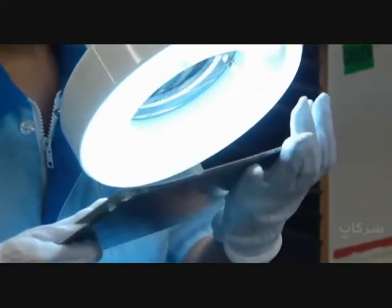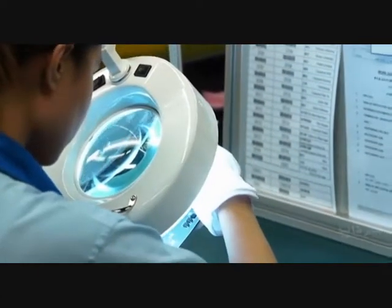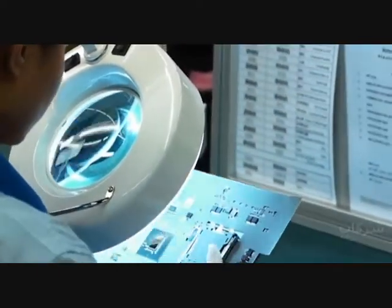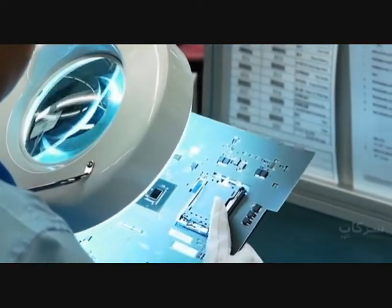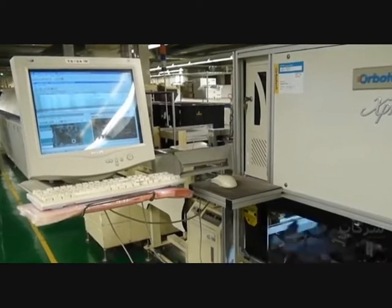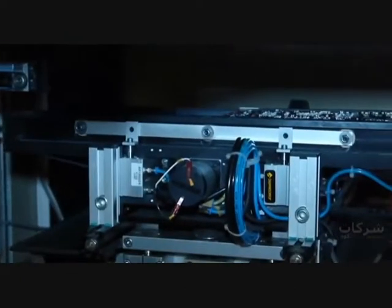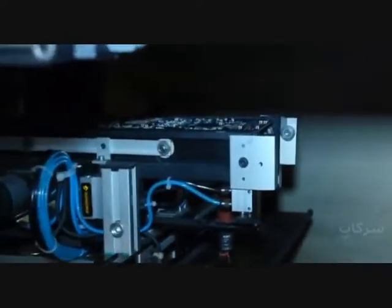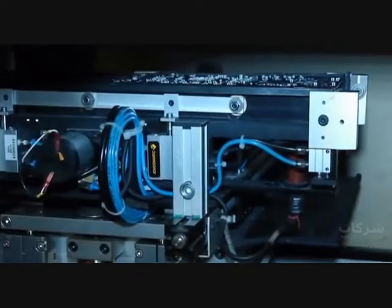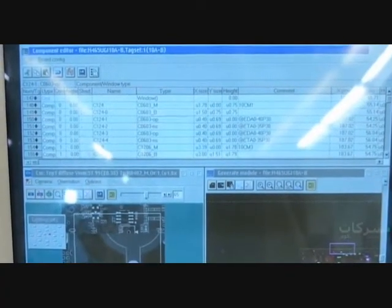Your motherboard now has all the small resistors as well as the chips and the socket, and it's time for the visual inspection. This inspection avoids any misplacements or missing parts. Components smaller than 2mm can't be checked by visual inspection, which is why we have the AOI machine. The automated optical inspection machine checks if there are any missing or misplaced components, and also checks all the components that have visible soldering points like the audio chip.